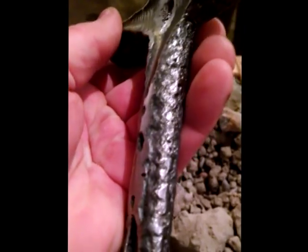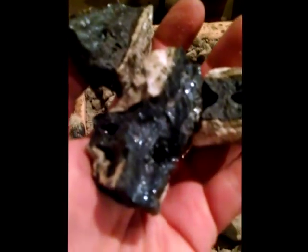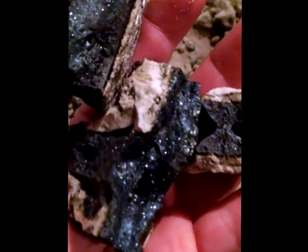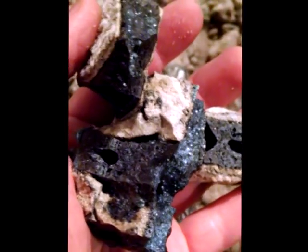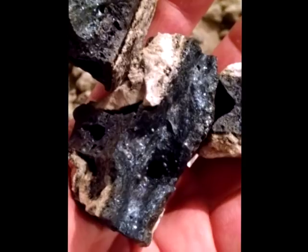The two of them fighting gives this uneven casting. On top of that was about double the thickness of the porous aluminum oxide — you can see right here this black spongy slag that sat on top, which is the aluminum oxide.